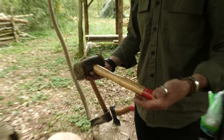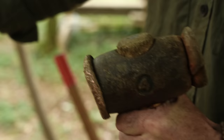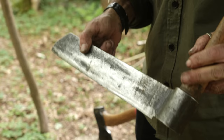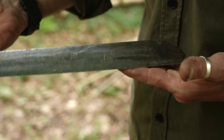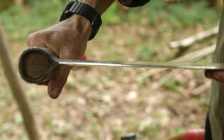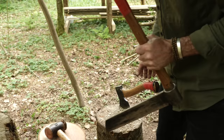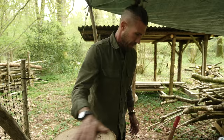With the shingle making, these are my main three tools. I've got my Thor hammer which is a good heavy hammer - you can use a beetle which is a lump of wood, but when I'm cutting shingles this size I really need something that's quite heavy for the job. The second tool is the fro - this is a Gransfors Bruk's fro, Swedish make, they make very good tools. It's got a good solid blade and a very strong handle because you're going to need to hit this a lot. And this is my little Gransfors Bruk's side axe, which I use for trimming the sides down once we've split the shingles.